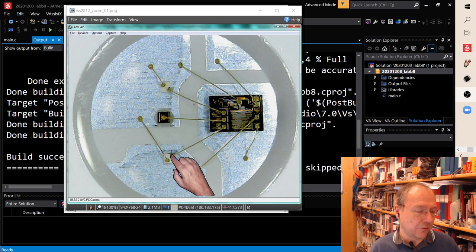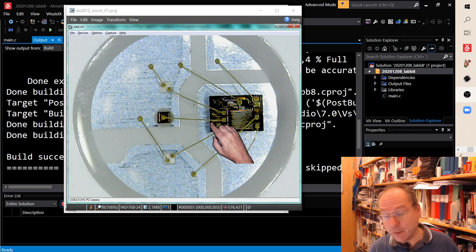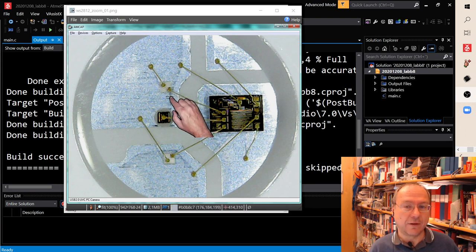The green and blue actually have two wires on the top, and this is because of the construction of the LED material. They are actually grown on an insulating sapphire substrate. So you have to supply both the positive and the negative side to the LED by wires from the top, while the red LED here is actually connected from the bottom with the one wire or one connection and the top with the other connection. But these three wires here send the information then, or actually it's a PWM coded signal, which they are sending to the individual LED chips, so that they can light up at different intensities.